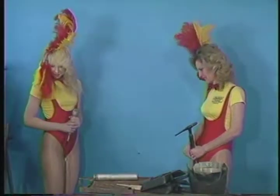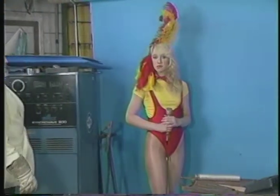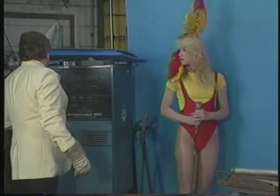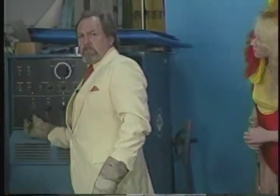All right, I'm over here now, and we've got to make some changes to this machine. Remember I told you we have to weld it on AC now, right? We need the alternating current. So this lever, and I'll step out of Chuck's shot if you've got that in a shot. Have you got that, Chuck? Yeah, 1 minute. He's going for it. Okay. Move this up to AC now.